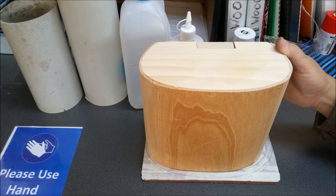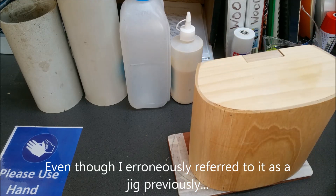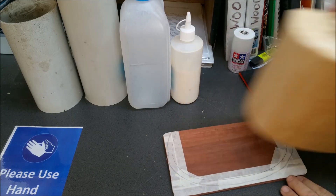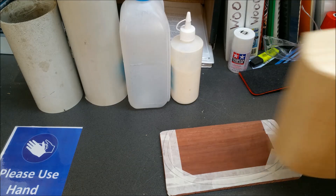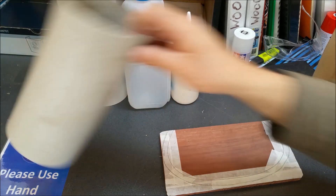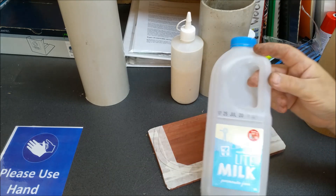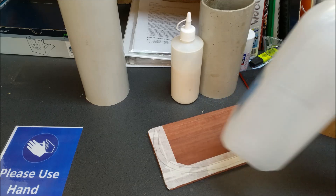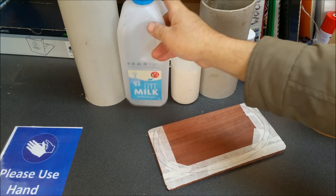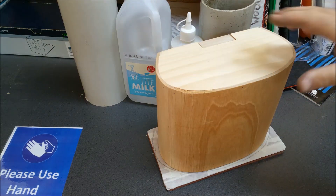Here's our buck — or form, which is probably a better term. It's not a jig because a jig holds things in a very specific way while you join them; this is just a forming thing. You can draw around it to get the shape of the stand we're going to make. The acrylic is three millimeters in thickness so there'll be six overall with two layers. Anything can be used as a buck — a piece of old PVC pipe works well. You'll find foam is very soft and not quite suitable unless you fill it with sand or screenings to give it stability.